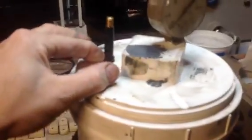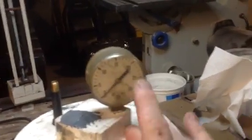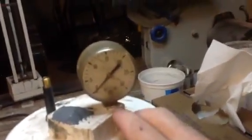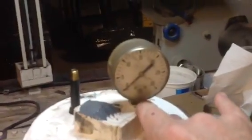So I put this on here and spin it around until it's tight. I have a gauge and a standard tire valve stem — I just drilled a hole in there, I think the hole is three-eighths, pulled it through, and that seals right up. Then I have my gauge here, and the gauge is not actually threaded into the PVC. What I did is drill the hole a little bit bigger and use some epoxy and sealed it in with epoxy.